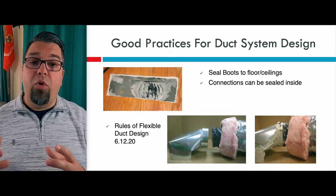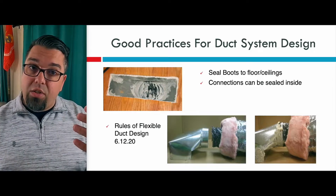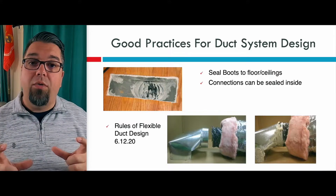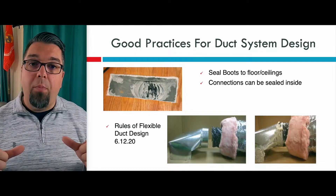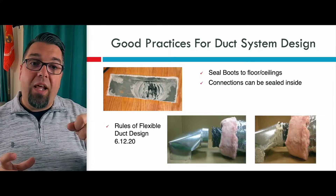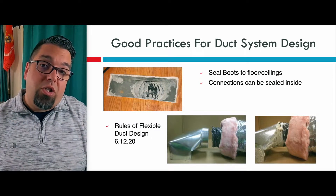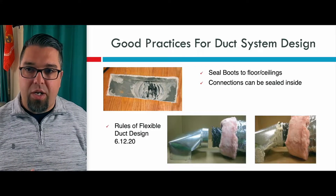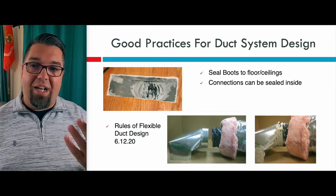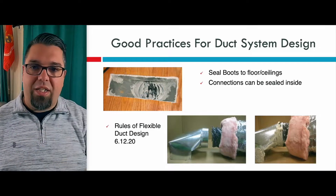In order to seal up, you don't just seal the main connections — you also have to seal boots to the floors or ceilings. A lot of times what I personally like to do is seal that with foam around, low-expanding, low-density foam. Then, before I put the register on, I'll seal the inside of the fitting to make sure that all of that is sealed, so all the air is coming to the conditioned space, or in the return, it's coming back from the conditioned space. We don't want to pull air from a basement or an attic. I actually used to just use a glove, stick my hand right into the sealer and get those fittings on the inside. It's really simple to do.